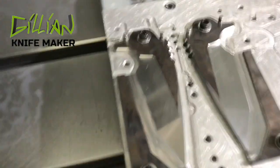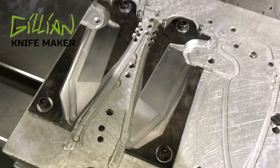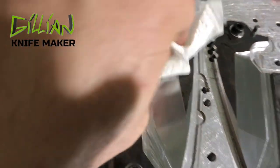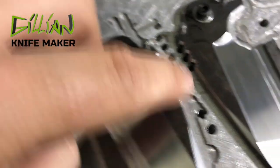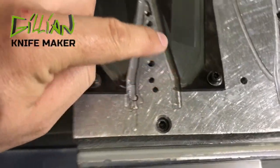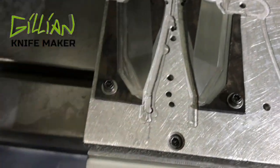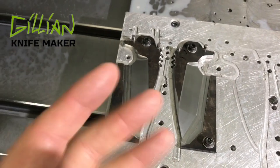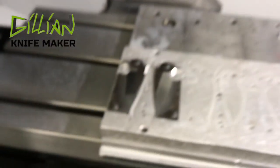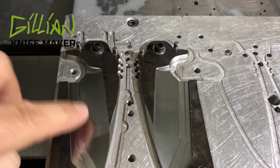Here's a picture of the bevels straight off the mill after the finishing pass with the 3/8" end mill — they look just fantastic. A few nice things about machining the bevels with the Haas: the plunges are absolutely perfect, and it has a very distinctive, very nice cheek. We'll come in and do some engraving here, and this flat area will ensure the knife always perfectly centers. It's very thick at the tip — about 40 thousandths — making for a very strong tip. We're now going to take them up, turn them over, and machine the back side. This half took almost two and a half hours, which is why most guys don't machine their bevels. But the result is perfect, smooth, and outstanding.